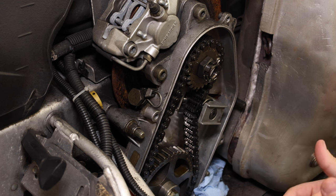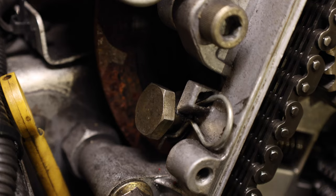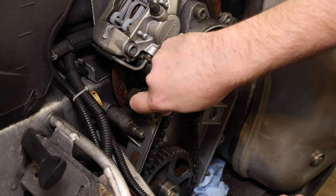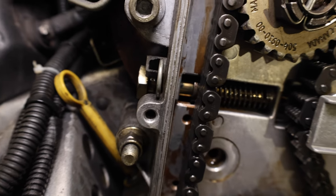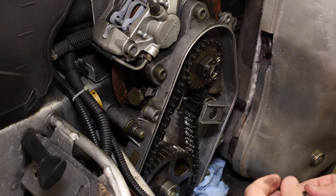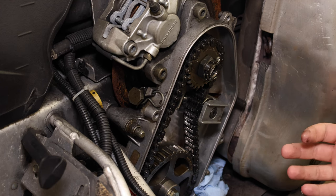Now that we've gone through and inspected the chain and the gears, we're going to turn our attention to the tensioning bolt. This bolt right here is the tensioning bolt. We're going to make an adjustment to it and see if it needs to be tensioned any more. What we're going to do is remove this clip here, and then turn this in as hard as we can by hand. Then you end up rotating it back to get this clip back in. I didn't need to add any more tension — mine was already in a good position, so the chain hasn't stretched.